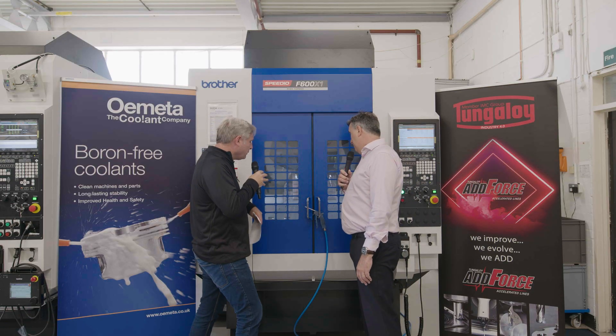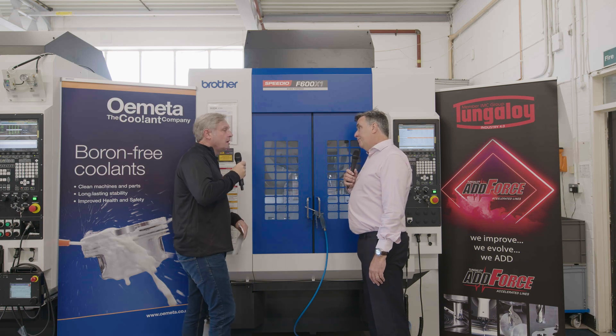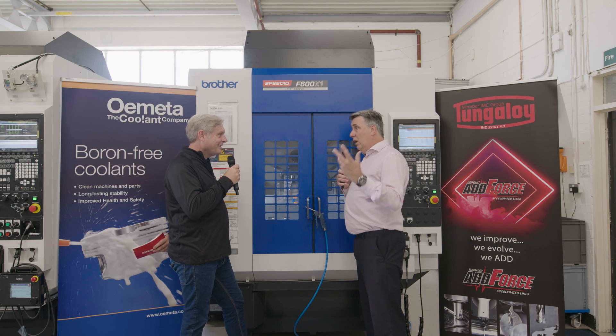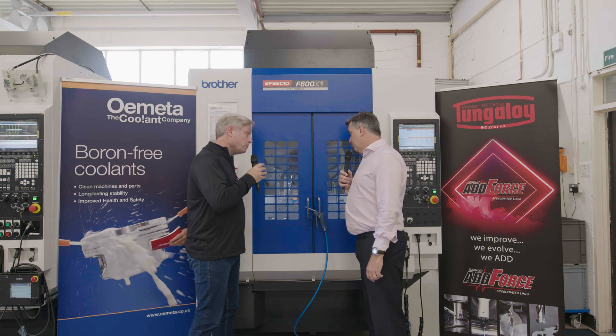I want to keep my spindle running — how fast is it actually going to measure these tools? The new LC50 Digilog will measure 60% faster than the previous laser system. Because we are now analogue and capture so much more data, we don't have to do any of the pre-positioning moves required with conventional laser systems. We can drive straight into the beam and capture the data in milliseconds. Just watching it — it's moving so fast.